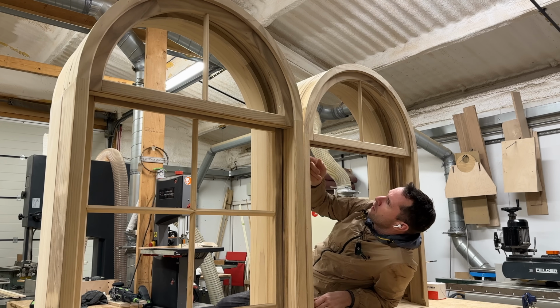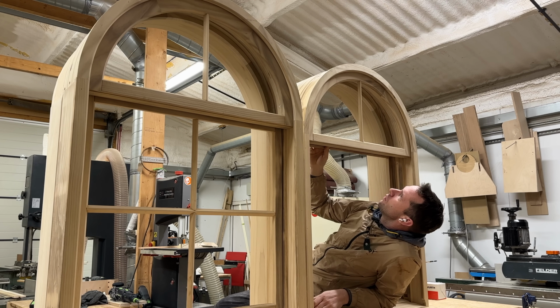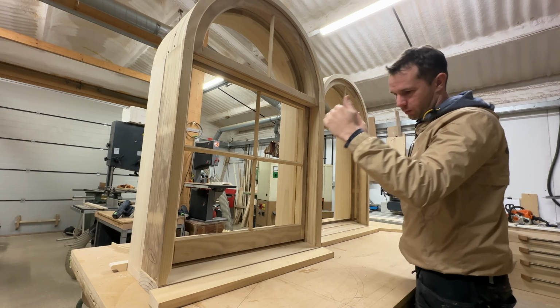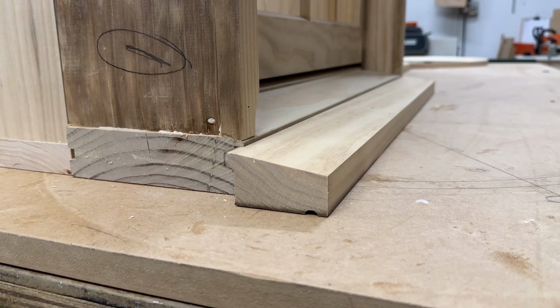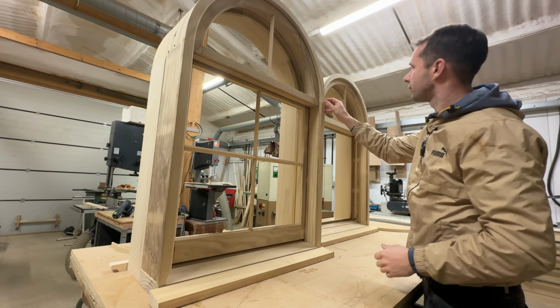If we go around to the outside, these are slightly unusual. They're on little sub sills. So normally a sash window is fitted on some form of stone sill that the water would run down onto, then away from the building. But this is just a completely brick opening, so we've gone with a sub sill that's going to take the water off of that facade of the building.